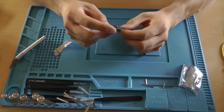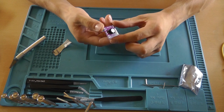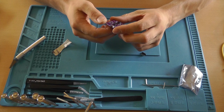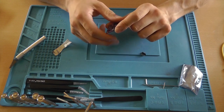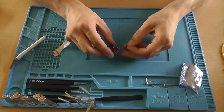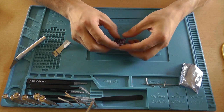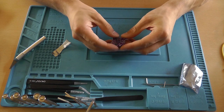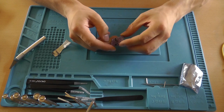And it even contains a 5.5 volt capacitor on the back, and I think that's used to supply the chip with power when the solar panel power drops, so it can still manage everything. And the page said it is capable of harvesting at very low voltages, so I'm curious.